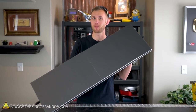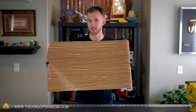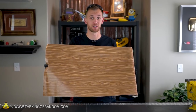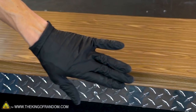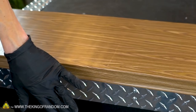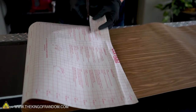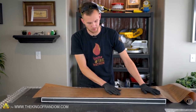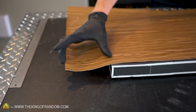We've added a stone texture spray to the bricks and I really like how it's looking, but this stuff can take a few hours to dry. While the textured paint is drying, let's make our mantelpiece look like it's actually made out of wood. We've got this wood grain contact paper which is kind of like a roll of tape that's 18 inches wide and 20 feet long. I'm using this color of wood grain because it was available at Home Depot for about 15 bucks. What we want to do is measure a piece that's long enough to cover our whole mantel, cut that off, then peel off the backing and attach it over the whole thing at once. I've got a little bit of a wrinkled edge here so I'm first just going to trim that off so I have a nice straight edge.